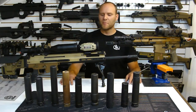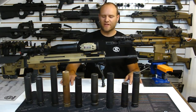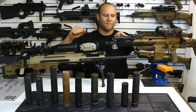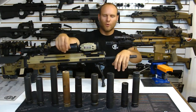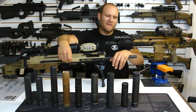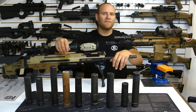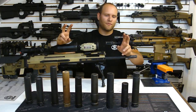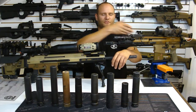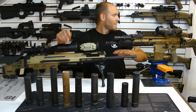Now you've got a bunch of information. How does this apply and what's the best way to make an educated guess as to what system is going to run best for your gun and application? We make a variety of gas jets here at PMM. Generally speaking, I don't recommend anybody run anything less than a 1.3 millimeter. I personally don't even like the 1.3 because in my experience it puts the gun tuned to the ragged edge of its functioning capabilities - meaning that as the weapon system gets dirtier and variables change, the gun might not cycle.